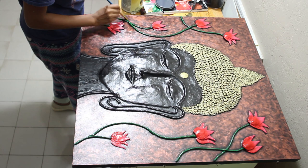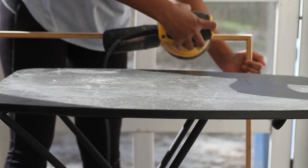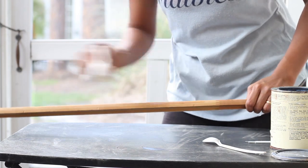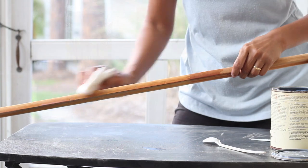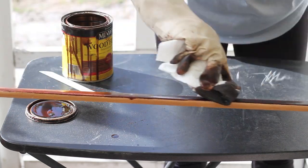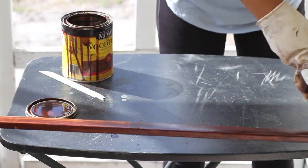Lastly it was time to upgrade the frame. I sanded the frame with sandpaper at grits 120 and 60, then used some pre-stain wood conditioner to help avoid streaks and blotches. Once the conditioner was dry I used a wood stain in the color red oak and coated the whole frame — make sure you wear gloves while staining. Finally I finished the frame by giving it a coating of shellac.